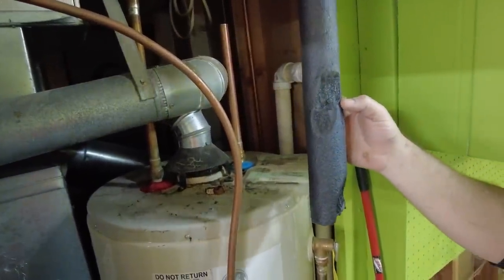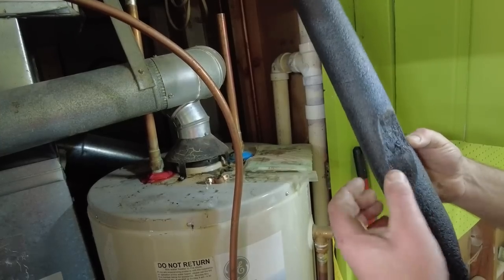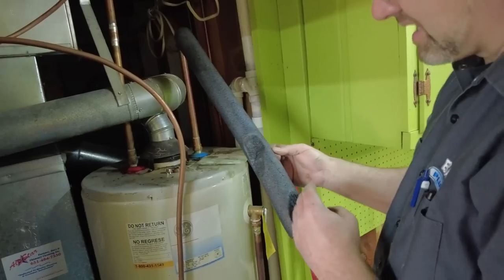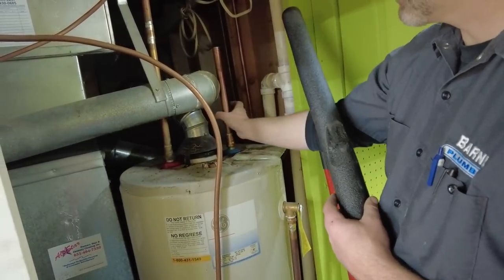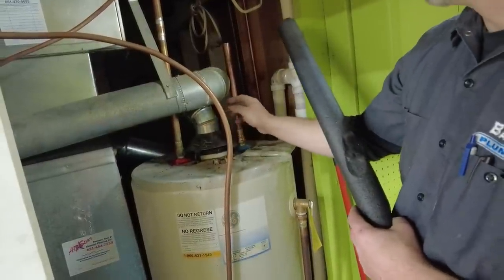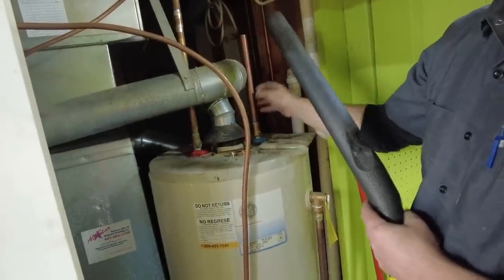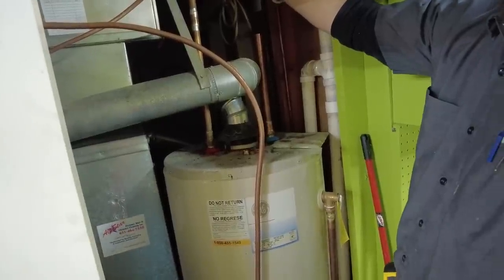Those are burns. A little hot. Now, I don't know miraculously how these things don't just light up in flames, but they seem to all melt like this. Whether this is there or not, with this metal pipe this close, when you use single wall venting you're supposed to have 6 to 9 inches. Well, that far, then you can't even. So this should have actually been way up here to get away from that.